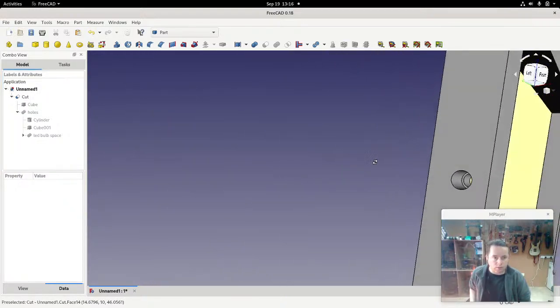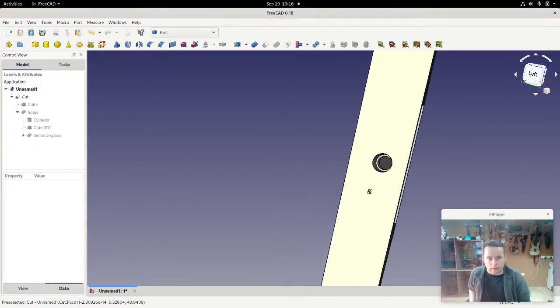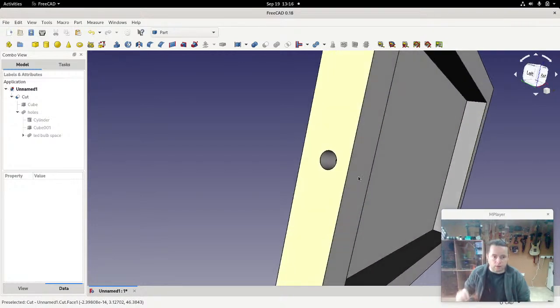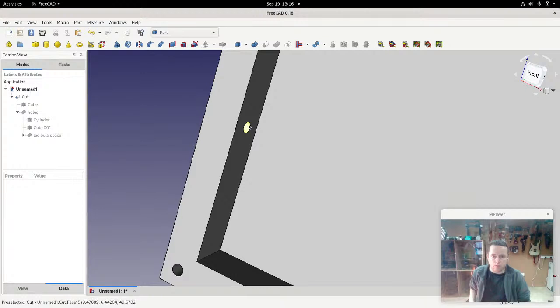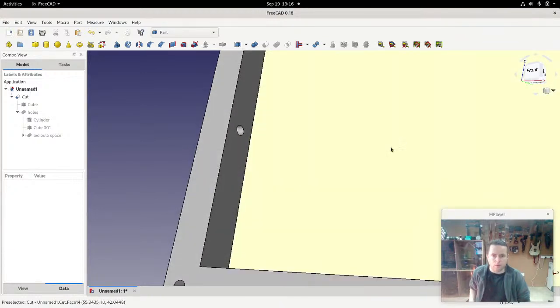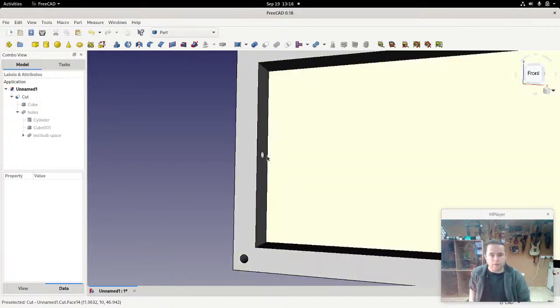But usefully, the hole has a diameter of 3.2 at the end and 4 on this side, which means that if we put an LED in, then the LED will stick at one point with just the edge of it poking out right here. Okay, so that's a perfect position for that, I think. Perfect. So the light from this is going to bounce towards the back, but it's also going to bounce slightly upwards and, you know, all sides.